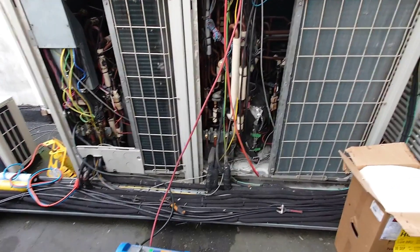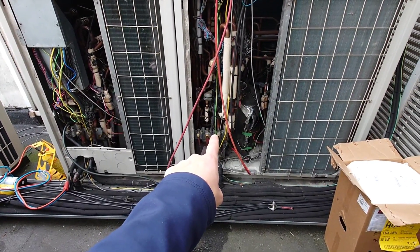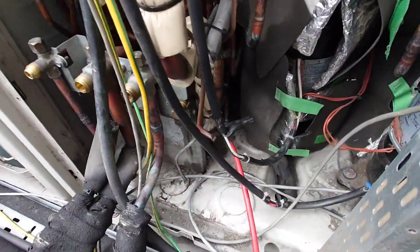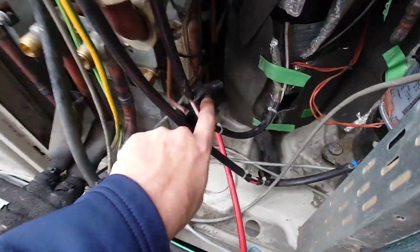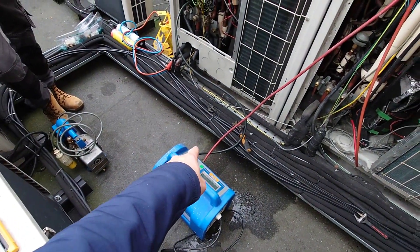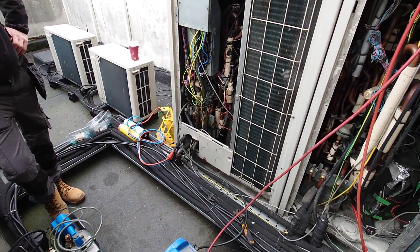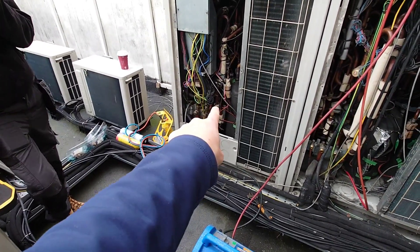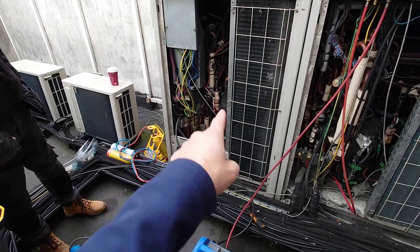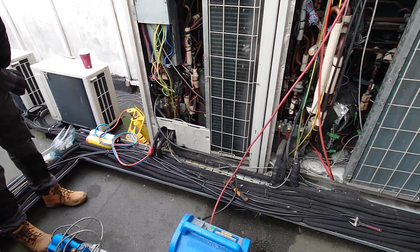The way we do this is we shut off the three ports on the condenser you're working on, so you're now closed to that condenser. Then we're drawing out the gas from the condenser via that internal port, through your gauge, out the gauge into the reclaim unit, out of the reclaim unit, and then back into the live side of the system. These three ports here are still open, so we're pumping gas into the condenser and into the field pipework just to keep the gas in the system.